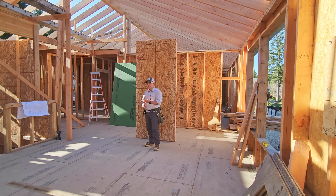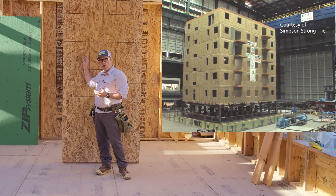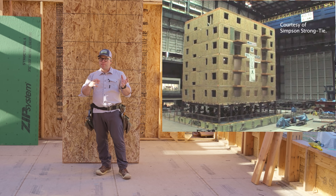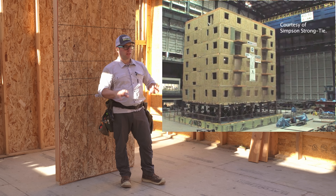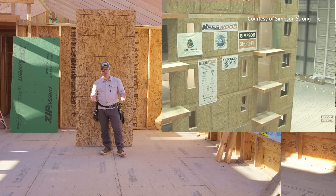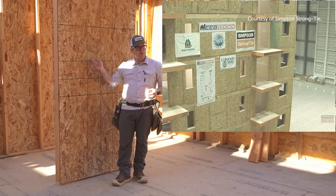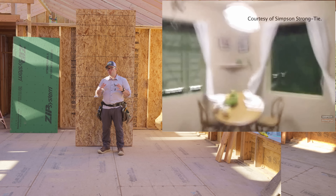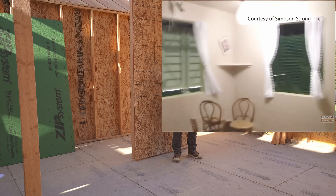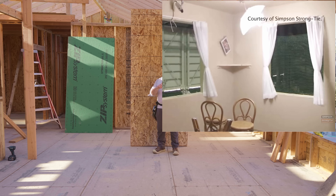So just a quick recap. We have wind and earthquake forces — those are our lateral loads. We're trying to keep our walls and the structure to stay in their shape. Those forces are going to transfer through the building and out into the ground either through load paths or through building collapse — clearly we want to avoid building collapse. There's a significant advantage in lightweight wood construction: it's easy to build, and because it's lightweight, the forces of an earthquake on a building are directly proportional to the weight of the building, so lighter weight structures see less forces. Additionally, wood can actually absorb and dissipate some of those forces — so it's rigid, yet flexible where we need it to be.